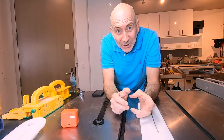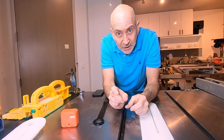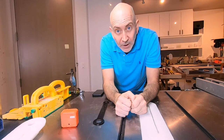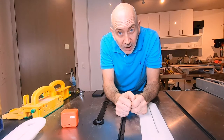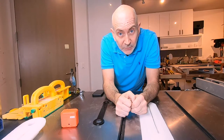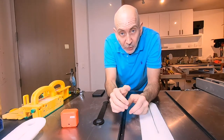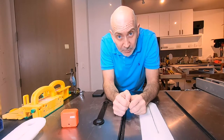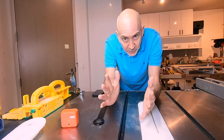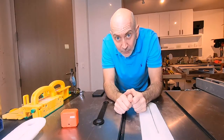You don't need a lot to get started, but plywood in a few different thicknesses and different qualities will be a good start. I recommend woodworkersource.com for plywood, and I think Baltic birch is a good option for many people for many projects. It will probably be bowed, so get it thinner than you think, because if you get half-inch plywood, you can then take two pieces that are bowed a little bit and glue them up and glue them flat, and you'll have a flat one-inch piece.